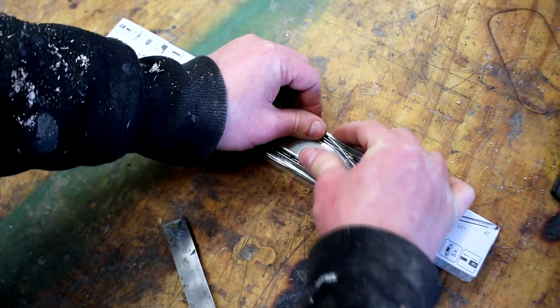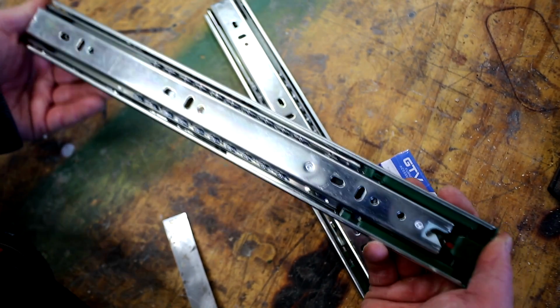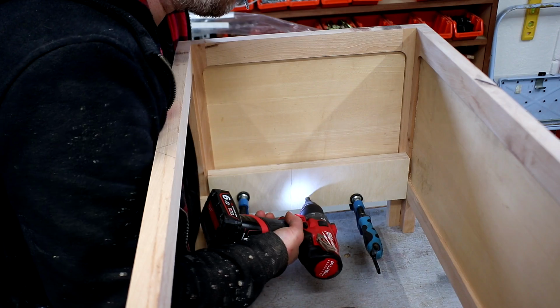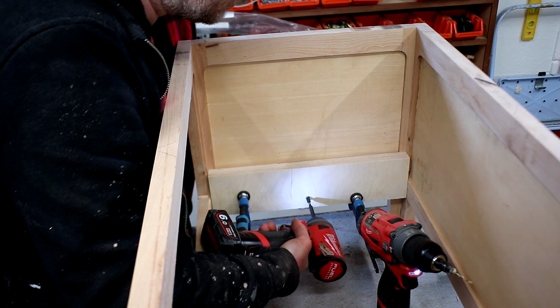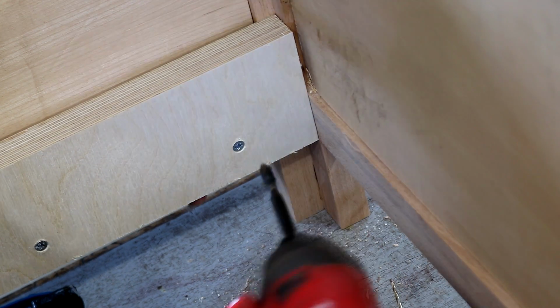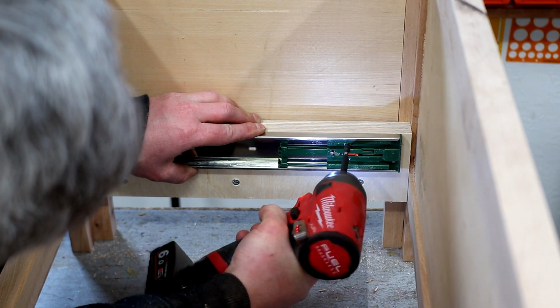The next day the drawer runners arrived. These are from Amazon, and I'll leave a link to them in the description box below. They have a push-pull mechanism in them. I checked that they measured 13mm in thickness, and they did, so then I could get my blocks screwed in place. I didn't add any glue here just in case I needed to remove them and adjust the thickness of them later on. But as it happens, I totally forgot that I hadn't used glue here, but more on that shortly. I can then secure the drawer runners to those mounting blocks.